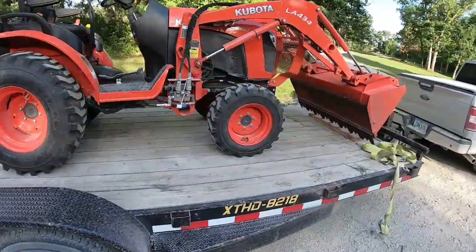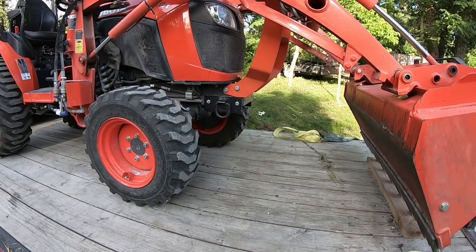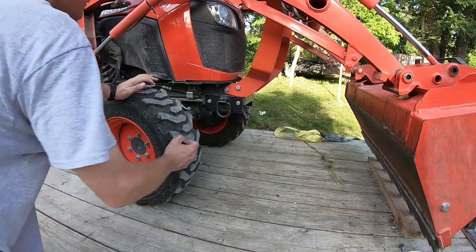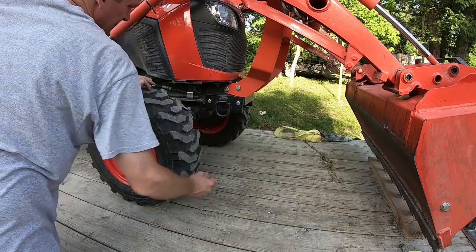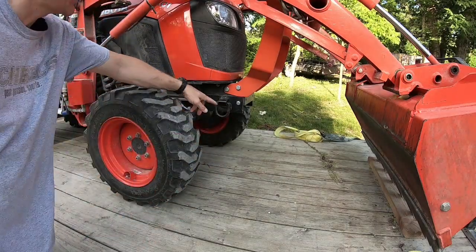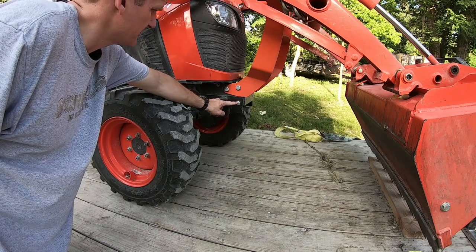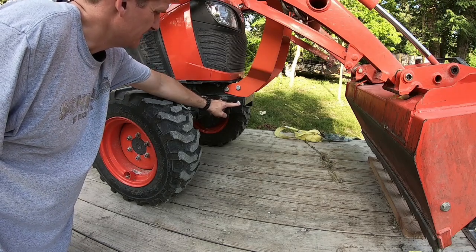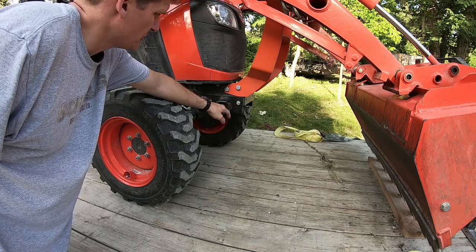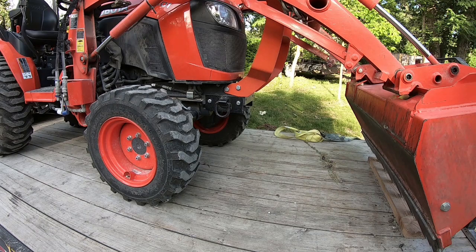For the front, I've got a plate here — this is quarter-inch steel, and I just welded a D-ring onto that plate. I actually use factory holes that are in the frame of the tractor, then drilled a couple of holes in that quarter-inch plate. Those provide perfect hooks for anchoring down the front end.